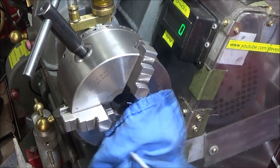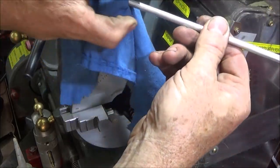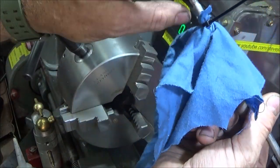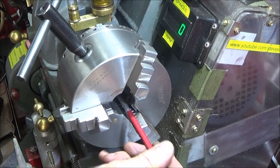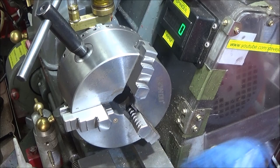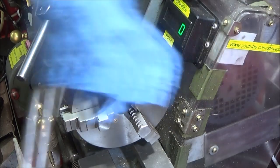The first thing I do is use this pull-through — it's just a piece of aluminium bar with a groove in it. I put a piece of cloth through it and a cable tie around it so it can't pull off. I stick it up the mandrel and pull it back, shake it out, and do that a couple of times to make sure the spindle bore is nice and clean.